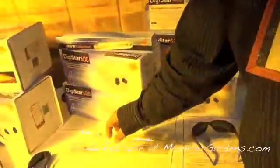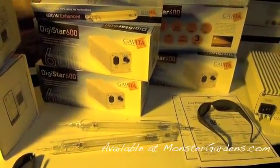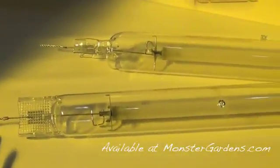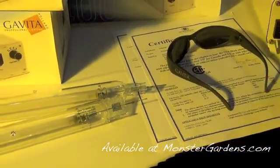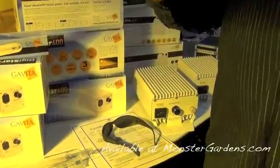These bulbs actually aren't 240 volt bulbs. They are 400 volt bulbs. Oh, super efficiency. The best efficiency. These work on 380, three phase. We actually made special electronics that convert 240 volt to the 400 volt bulb. So that was Philips, right? That's Philips. Our ballast has to be checked. Philips is checking our ballast to make sure that we don't run their bulbs on a bad ballast. Okay. And so we can actually certify those bulbs on our ballast.